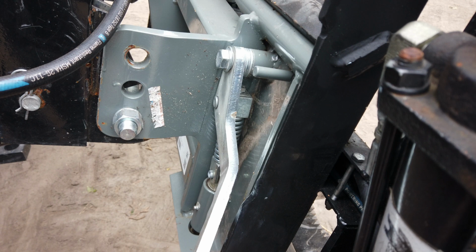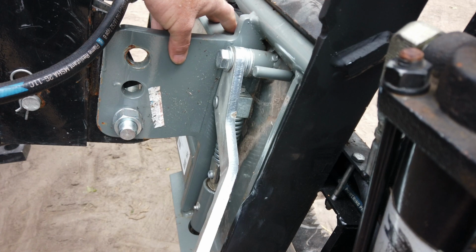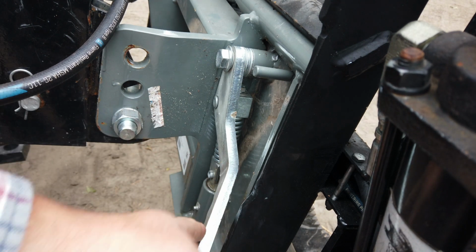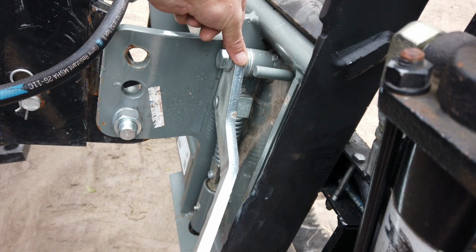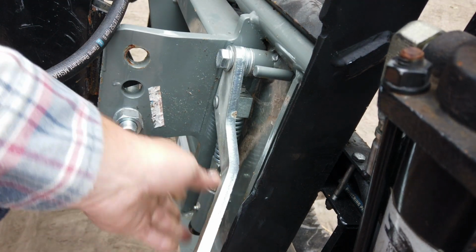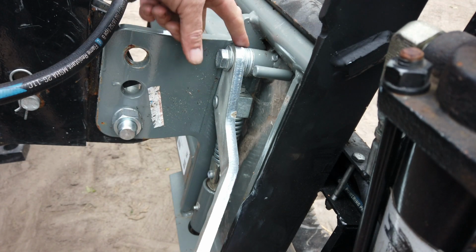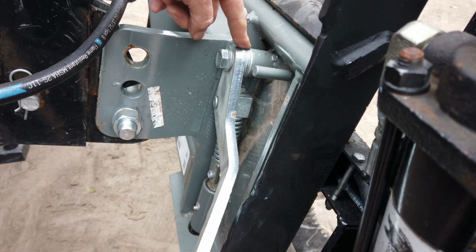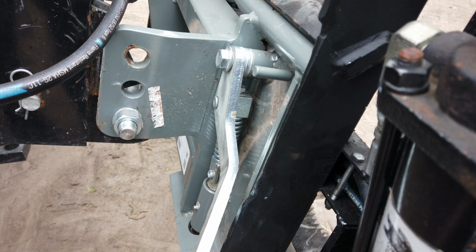One other flaw with the Work Saver, though, I will say. First off, the build quality of this thing is great. Finish, design, everything's great. The only caveat to that being these handles. And I also put 4 large washers in here to bring this out a little bit. When I initially got this, I tried it with my tree puller first. Couldn't use it. Couldn't use it with my bucket. Certainly couldn't use it with the grapple for the reasons mentioned. I wanted to use it with my tree puller, see if I could get that figured out. Didn't need much for that, so I spaced this out, and then it worked with my loader bucket, which, again, works for a good carry-all, but nothing else, right?